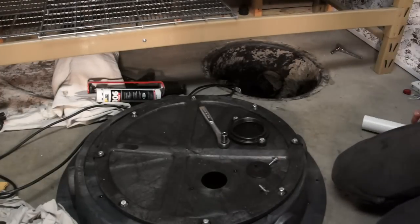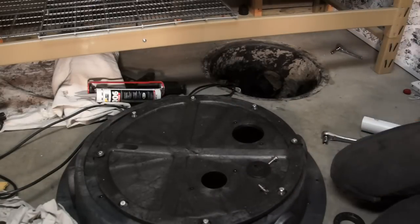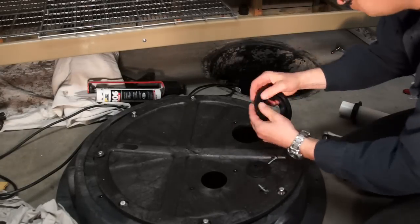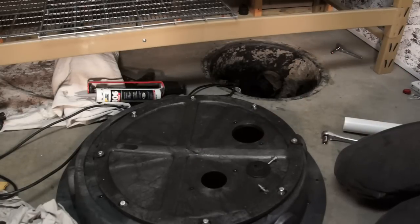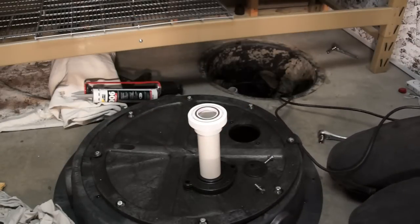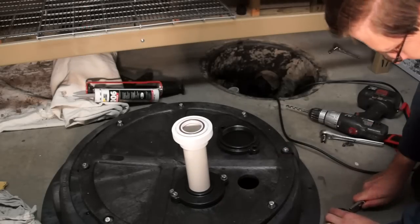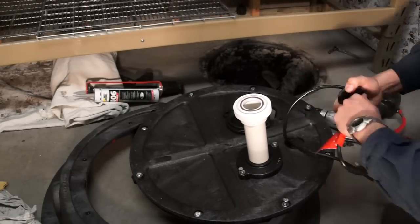Over in the laundry room is where we actually drill the hole in the concrete and put the pipe that's going to go up in the garage. This process just takes a little time to figure out how to get your PVC pipe to seal up. Once I figure out the correct fittings to put this together it went together pretty easy — this whole project took with the sump cover about maybe two hours. The nice thing is it comes with all these rubber boots and stuff so you can run the cords through it and even seal the hole where the cords come up.